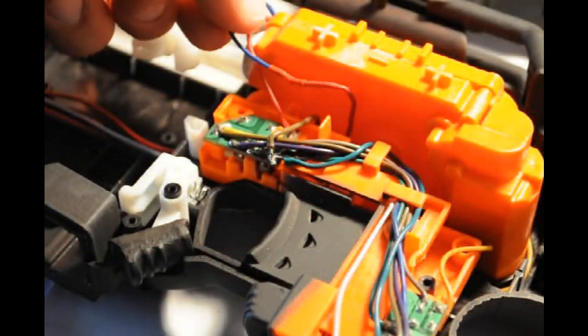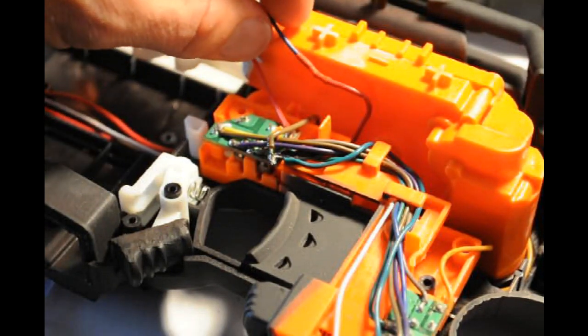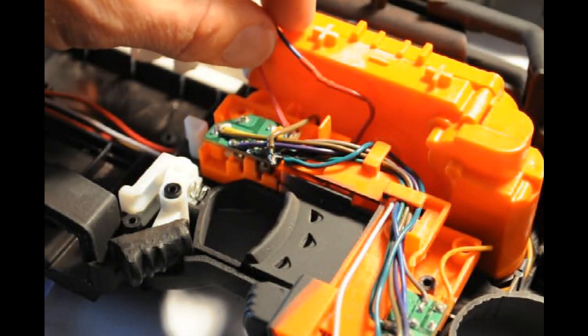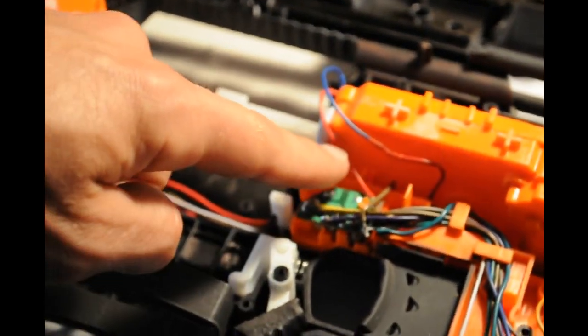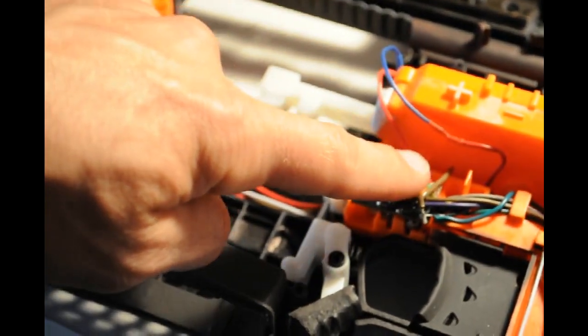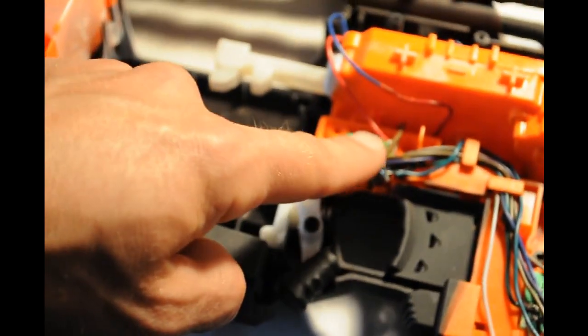I went ahead and, from last we talked here, I soldered that blue wire. That's one of the two positives on this switch here from the dart pusher. I wired that into the positive lead of the LEDs over here. And then I took this other positive lead on the other side of the circuit of the switch, and wired that into that little pad on the top, which is the positive feed of the main battery out here. So that feeds all the way to that pad.